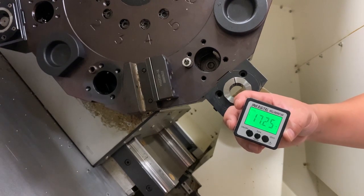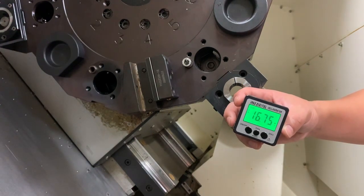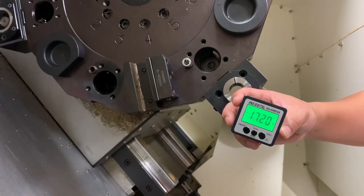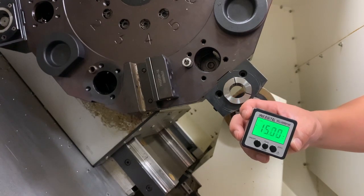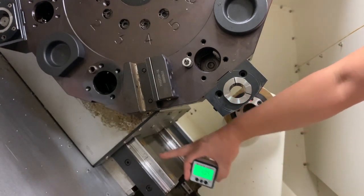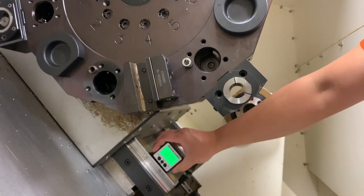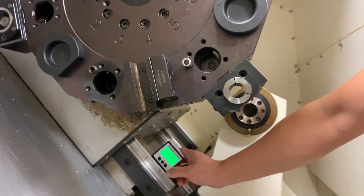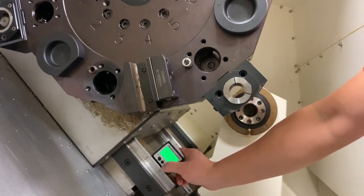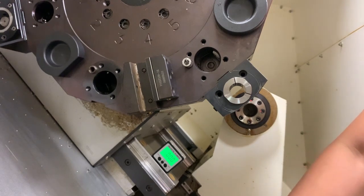The digits are showing the angle in reference to the horizontal plane, and it works like a spirit level. There are several reference surfaces you can easily find in the turning machine, and the most common one is the guideway where the turret moves in the Y-axis. If I put my digital protractor on this reference surface here, I just need to press zero, and the digital protractor will take this plane as our reference plane for alignment.